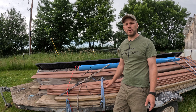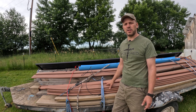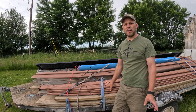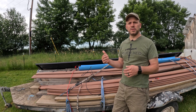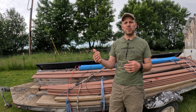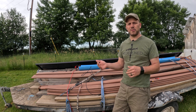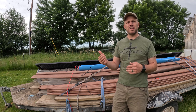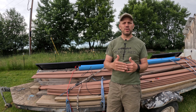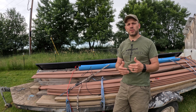I'm going to show you how to get that wired up the proper way without wrecking anything. With these panels and this configuration, the maximum amount of input you'll probably ever reach is about 1600 watts. That is because these panels are only rated for 40 volts and the maximum voltage input of the power unit is 60 volts. If you had a panel closer to 60 volts, you'd reach a higher wattage, but you're limited by the voltage — the lower the voltage, the higher the amperage. The amperage rating on these units is only 25 amps.